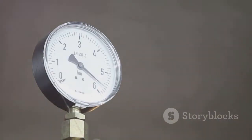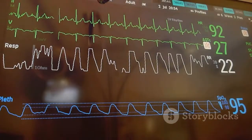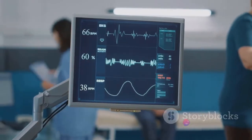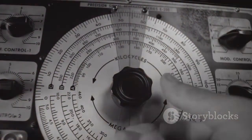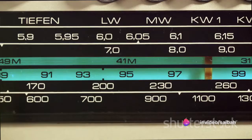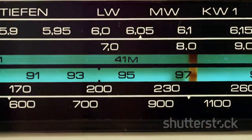It's like testing a car at different speeds to see how it performs. If we discover that the transmitter needs calibration, we use the HART communicator — a handy tool that allows us to interact with the transmitter and make necessary adjustments, like a remote control used to fine-tune your television settings. One of the key adjustments we can make using the HART communicator is the zero and span trims. Zero trim sets the baseline or starting point for the transmitter, while span trim adjusts the range or extent of the measurements that the transmitter can handle.